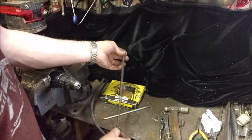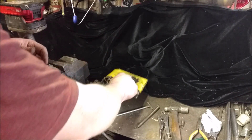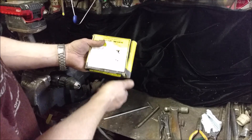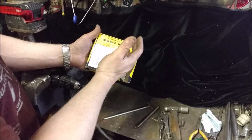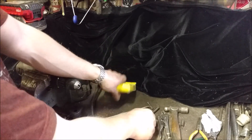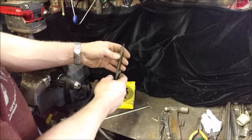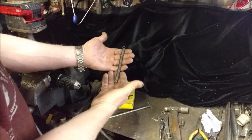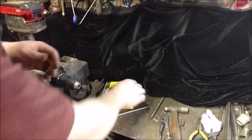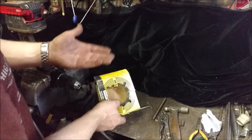Here we got a nice, probably five inch spring with some good tension to it. What you're going to need is spring steel — music wire. I'll put a link below. Music wire comes in a bunch of different gauges. Thicker means a stronger spring, but also harder to make. For most automotive and general purpose stuff, you can make all the springs you'd ever need just by playing around with music wire. You can also get it for free by scavenging from tires — I'll show you how at the very end.